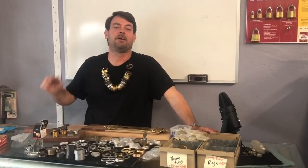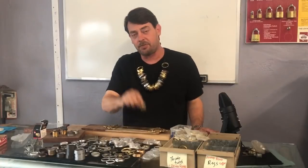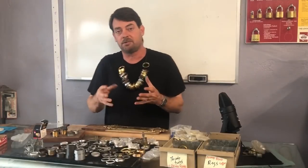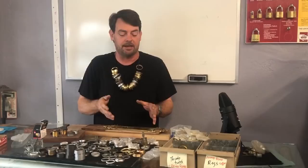What's up guys? We are going to talk about spacer rings today. Spacer rings are used with mortise cylinders, typically on narrow style glass doors or on metal doors with a mortise lock mechanism on it. It's very common to see this on the commercial side.